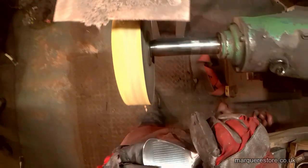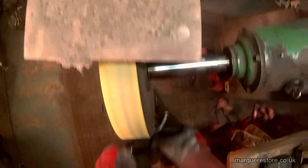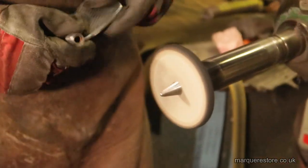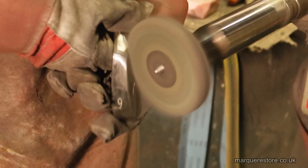It's a very careful process — you've got to go really gently with these items. We've now changed to a different type of tool altogether: this is what's known as a felt. It's made from felt but it's quite a hard wheel, used for getting into grooves. Then we changed again to a mop dressed with an abrasive compound, so it can go into recesses in a soft way — whereas a felt has to be shaped to fit the article.